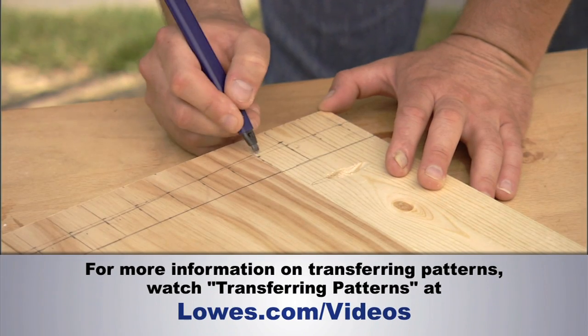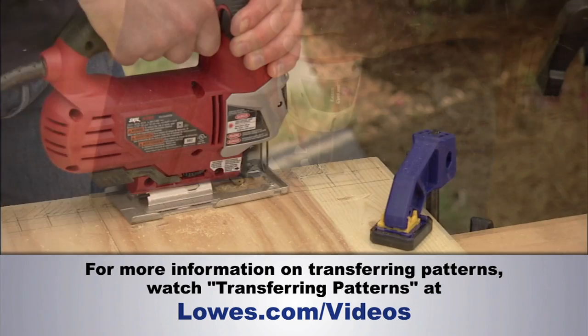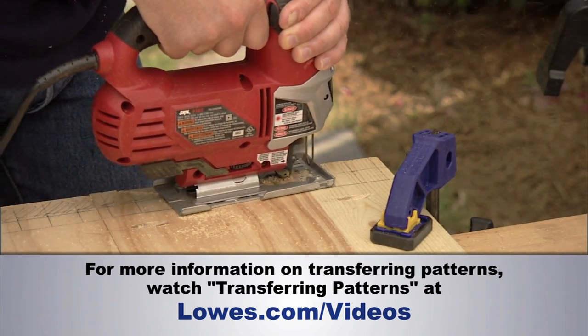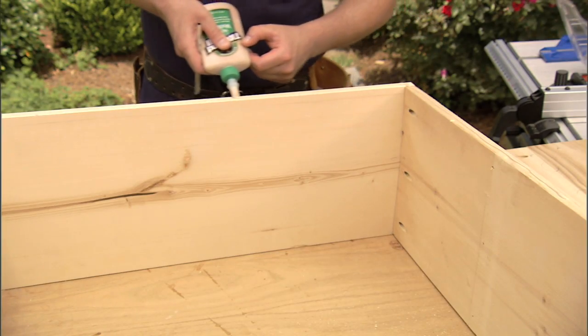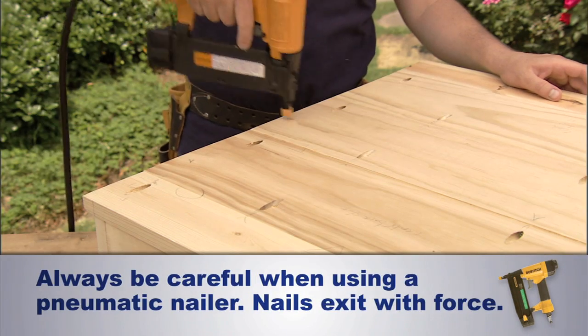Because the front of our bookcase has a skirt with an arch design on it, I want to match that design on the back assembly of the bookcase. I'll do that by transferring the pattern for the arch to the back assembly using a grid. Once I trace that design onto the back assembly, I can clamp it down onto our work surface and then cut the arch out with the jigsaw. Now we can attach it all together — after I apply my glue, I can attach the back to the top, bottom, and sides using nails.